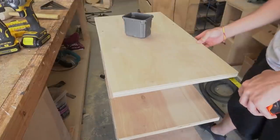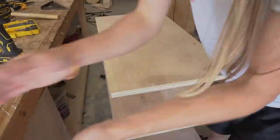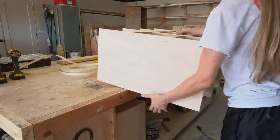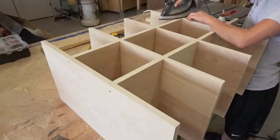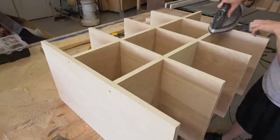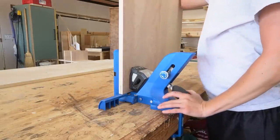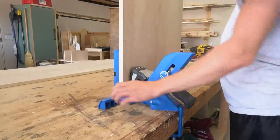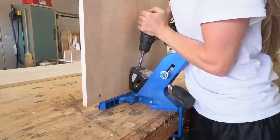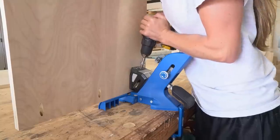I screwed the outside piece on using wood screws. These screws will be hidden once it's installed in the top section, so I wasn't worried about them showing. I edge-banded the shoe cubby pieces before assembling, but I ended up sanding most of it off because I got really messy with the glue, so I reapplied it again after assembly. This was by far the most stressful part of the project, but once the shoe cubbies were together, I took a break from the hard stuff, set the cubbies aside, and moved on to my favorite thing — drawers. I will come back to the shoe cubby later.